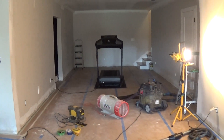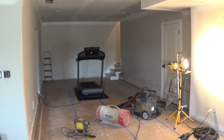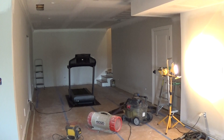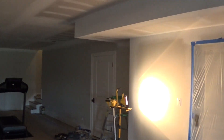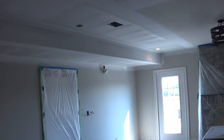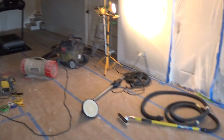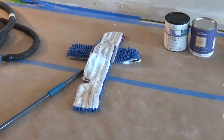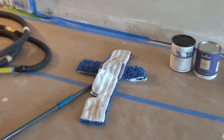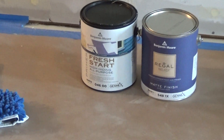So we're going to look at a few of the tools that can help you be dust-free. We're also going to look at some tools you need if you've had a job that was not dust-free and you need to get rid of all this dust on the surfaces prior to painting and priming. A common problem is drywall dust being painted over because everybody's rushing the job. In this particular case, all the walls and ceilings were vacuumed and they're going to be wiped with a microfiber mop to prepare for the application of our Benjamin Moore Fresh Start primer.